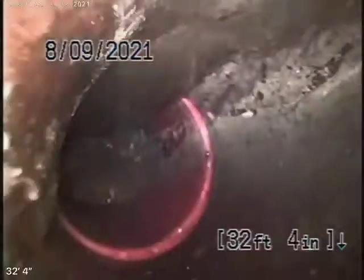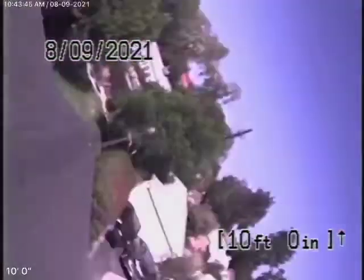The pipe actually exits the back of the house. Right over here you can see some pretty heavy roots — this is where the pipe exits the house at the back. It comes back to a very old section of cast iron pipe running underneath the foundation, with roots coming through it. Then we come back to ABS plastic, which is in good condition. We're definitely going to recommend that the cast iron be replaced from underneath the foundation to the outside, and that a clean-out be installed on the outside of the house, because there's no way to really clean that section of iron.